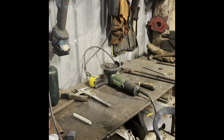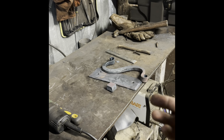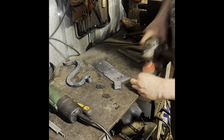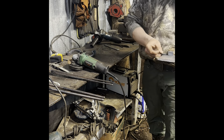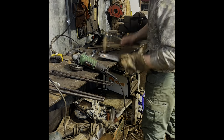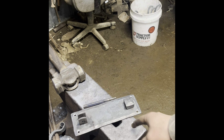Right here I'm just using the Dragon's Head door knocker I made as a template to mark out where the hole needs to go. I got the hole drilled in the knocker. The last thing I'm going to do before I start welding it together is wire brush the whole entire thing, since when it's welded together there will be some spots that are hard to get to with the grinder. Now I'm centering the strike plate on the back plate so I can weld it up. I drilled the screw holes and I'm going to go ahead and rivet the knocker onto the base.